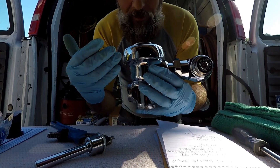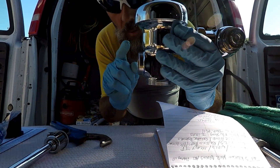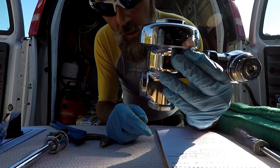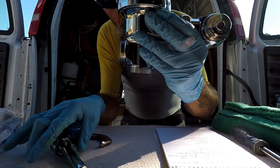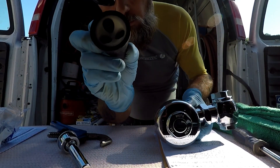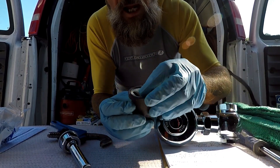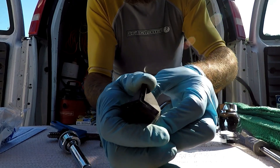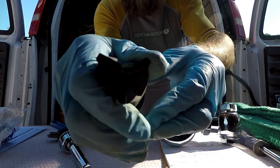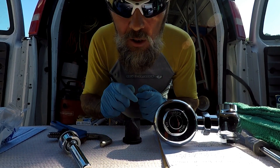This is what your valve usually looks like when you're using the bathroom — with the handle in place just like this. One of the most important and commonly replaced parts is located right underneath where your handle would be: the vacuum breaker on the standpipe that puts water into the toilet. When you flush, water leaves the lower chamber and goes down through this vacuum breaker. You can see it opens a little rubber piece, forcing water to go down — that's why when you flush one of these valves you always hear that pressurized sound.